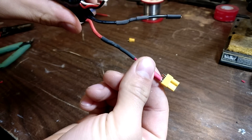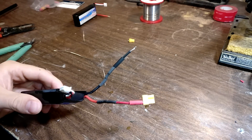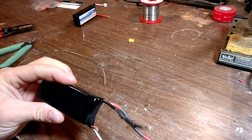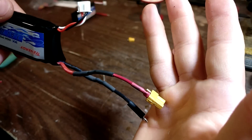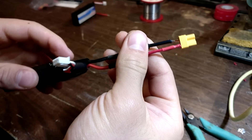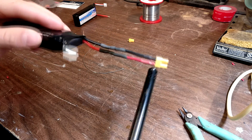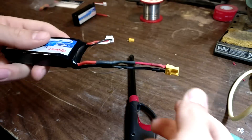Your first side is now connected and ready to go. Bring up your shrinking tube and heat it up, let it shrink down. You now have a finished joint on the positive end. Now just do the same for the negative. Both your sides are connected and good to go — bring the shrinking tube up and over, heat it up, and let it shrink down. There's one completed battery ready to go right into the drone.